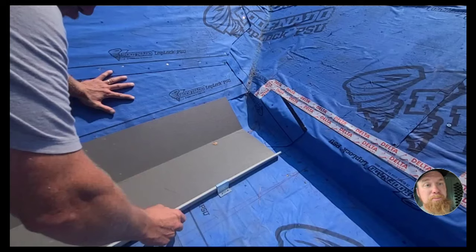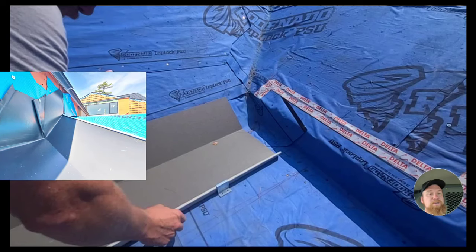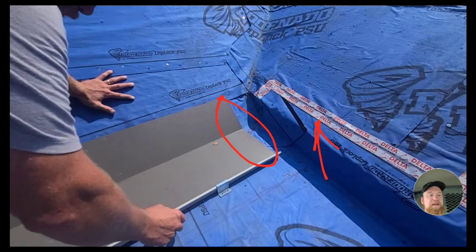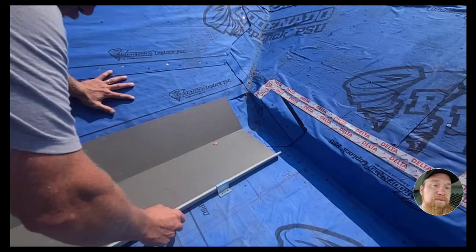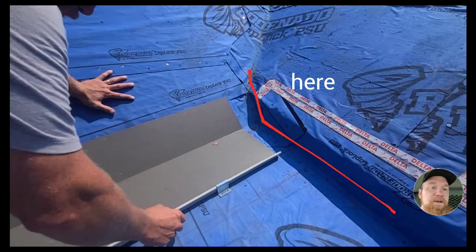Here's what I plan on doing today — it's a little different but I think it's going to be effective. I can also draw on this, so I'm going to pause the video and explain what's happening. This is actually a really great teaching tool. What I have to do is turn this edge up the wall here — this piece has to get mitered into this wall. This line here to this wall line is not 90 degrees because it's not square, so we have to do something a little different.